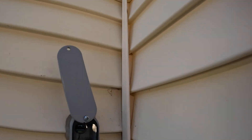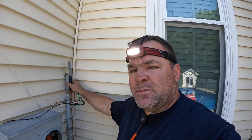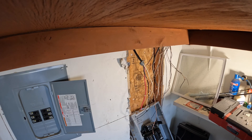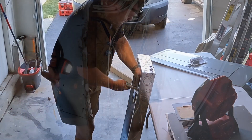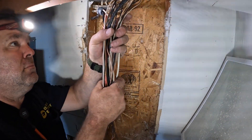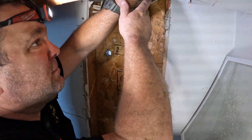I'm wondering why the panel is holding in. Do you see that coarse screw going into the LB right there? What that does is it holds the LB in place — you're not supposed to drill through there, but I'll admit I'm guilty of that sometimes too. Once I removed that screw, that panel came right out. The panel was held in by the screw through the LB, and when I took that screw out from the outside, the panel fell to the floor.